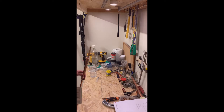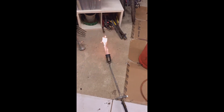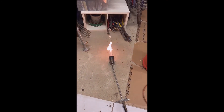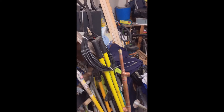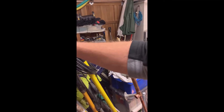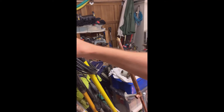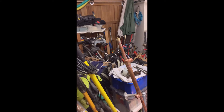Now we're going to get our heat gun and basically heat this end of the pipe until we get steam coming out that end. Once we've got steam coming out, we'll seal it back up and we're done. For this next bit, we're just going to use our roofing torch. Make sure wherever you do this you've got plenty of space and air — garage doors are open so we don't have a problem. I'm going to put the torch onto the bottom of the heat pipe, and hopefully you can see some gas venting out. Once we've got steam coming out, we'll pop the cap on.